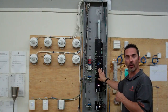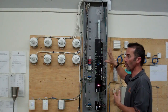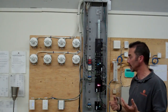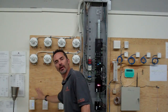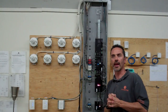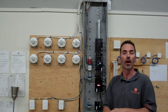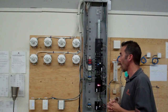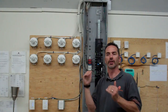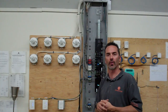Then we're going to work with either the homeowner or a lighting designer, if one is on board, to organize all the scenes, create all the different dimming levels, name the scenes, get the custom keycap engraving. All that's going to be taken care of by us. And then if there is a lighting designer involved, the extra step is we do a night meeting with the light designer and the owner, where we review all the scenes when they would actually be used and adjust them accordingly. And that is the scope of work of the Control4 Panelized lighting system.